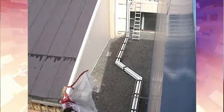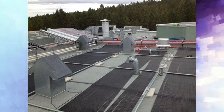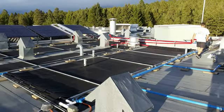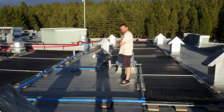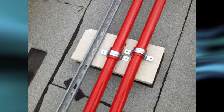There really is no other proper engineered solution for solar pool heating on a flat roof. It's important on a flat roof to protect the roof — we don't want to interfere or penetrate the roof in any way. Our ballasted system uses a framework of locally available chain link fence top rail, unistrut, and patio stones. Pretty much everything else is supplied by Hot Sun, including design and layout specifications. Don't forget to read the general installation instructions, the manual addendum, and the drawing. You can take the drawing on the roof with you. We can prefab the solar panels for you in fixed lengths, or you can custom fit them to the roof by building them on the roof to fit the roof. Let's see how Mike puts together a prefab manifold assembly.